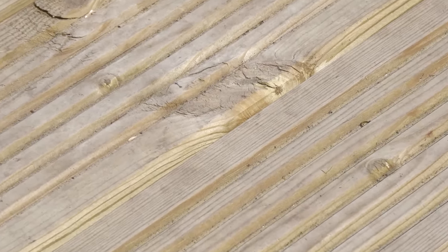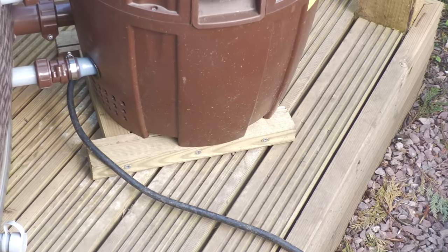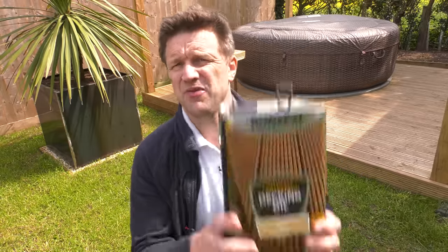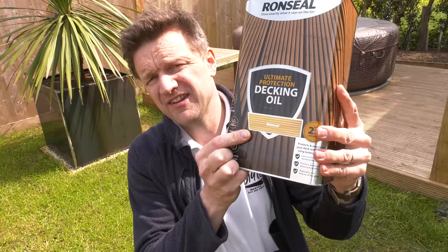So what's the conclusion? The groove-up haters will point to how quickly it rots or gets grimy if you have your grooves facing up. However, if you look at mine — seven months after the install, after a pretty nasty winter with almost continuous rainfall and my entire garden and paths covered in moss — the decking is actually looking remarkably good. Just a bit dirty as you'd expect, and the concerns I had about standing water just haven't materialised. In a few months' time I'm going to give the deck a good scrub, pressure wash, and clean with a decking cleaner, then seal it with a premium decking oil — both bought from Harlow's. This is just a neutral colour, which will seal the deck and make it easier to keep clean.